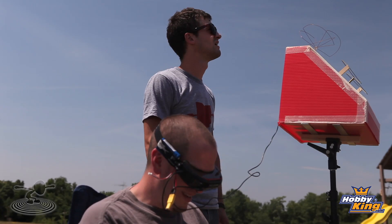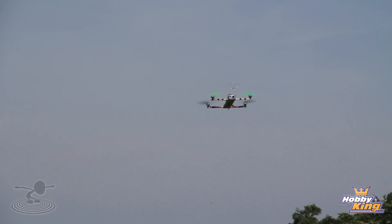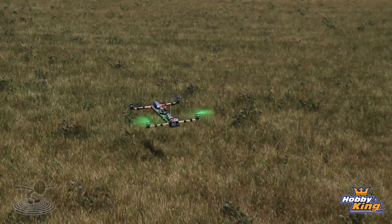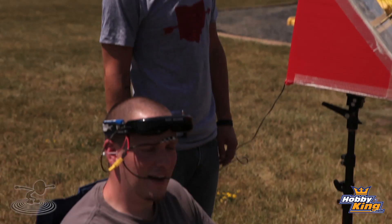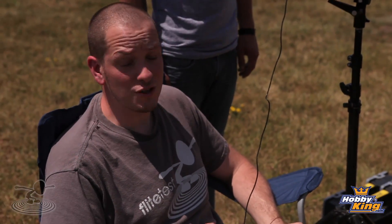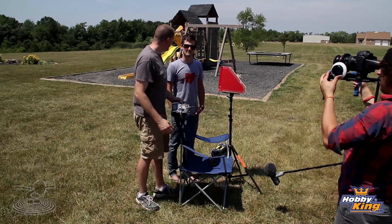One thing to note: I'm not sure how much battery I have left. Whenever you fly a new frame, check your battery level before it falls out of the sky. Also, I don't have my ESCs programmed correctly — they're set for NiMH cutoff, which means I'll get a hard cutoff on LiPo. I'm not happy with the vibration either — I need to do more balancing. I had three-bladed props earlier and was happy with the performance but the power wasn't as great, so I switched to two-blade. To dynamic balance, disable other ESCs, spin one motor up with throttle, feel the boom, and add tape to the opposite side of the blade on each individual blade while spinning.